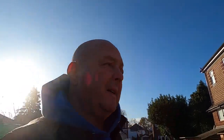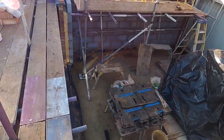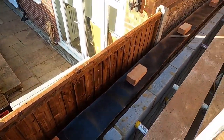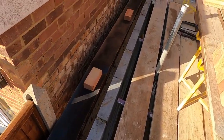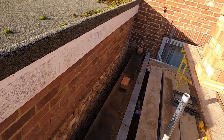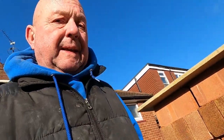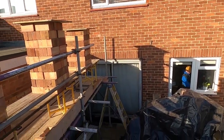Too cold to lay. We've loaded everything out and covered everything up. For the scaffold — I've explained it in another video — with overhand work, always have your scaffold the same height as your block work, then you can stand on the block work as you're laying and you won't give yourself a bad back. Next week I've got an RSJ to go in there. If Melvin can get the RSJ, we may come and put that in.